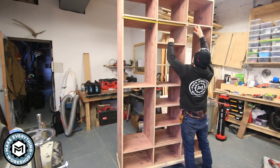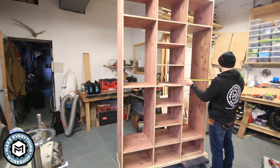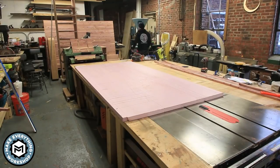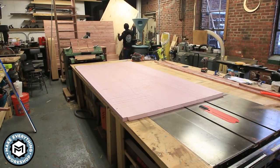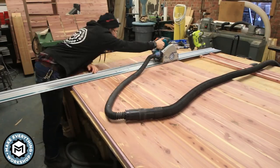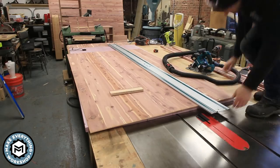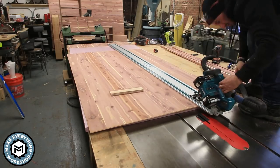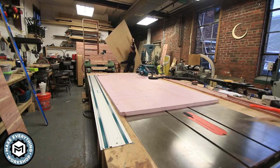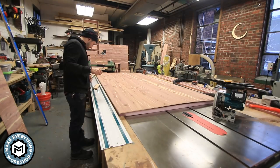Now that the nosings are done I did the back panels. The back panels had to coincide with how the shelves are built in pieces, so I measured out in different sections. I'm using quarter-inch one-side veneered plywood and the track saw to rip it up, again using the pink foam as a cutting substrate so I can rip right through the material into the foam without worrying about dulling my blade. This really makes the process of using a track saw so much easier - I highly recommend a piece of this foam.